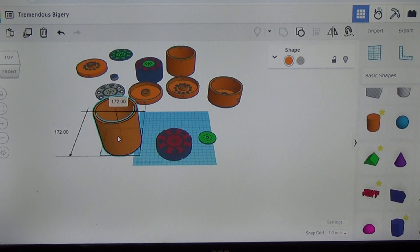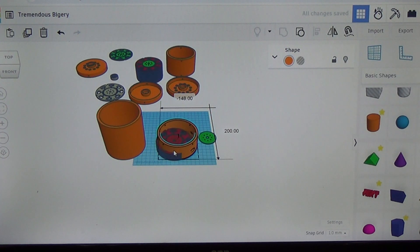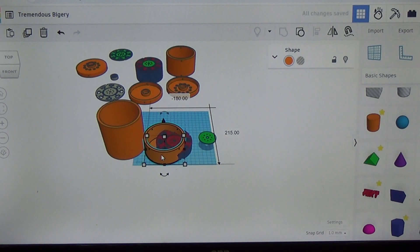We'll grab the case from the old original design — you can see how big that case is. Today's case is only this big. So you can see we've reduced the amount of blades in our turbine by about two thirds. With the limited hydro flow I was able to devote to this turbine, it seemed like I had way too many blades. I have a feeling the overabundance of blades was hindering actual power production.